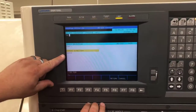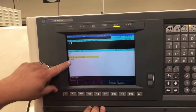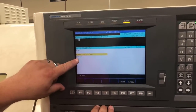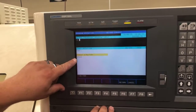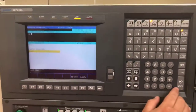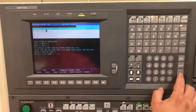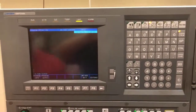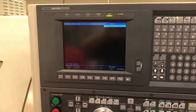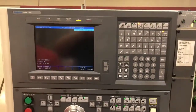Once it has come up, I will see all the programs loaded on my floppy drive. Before I put this into my floppy drive, I put my program on the floppy as 02533 — no .txt after it, it is a file type format. All I have to do is cursor down to highlight it, push the right button once to select it, and then hit right again to put it into my control. It will take a second — and the copy is finished. It is now in there.